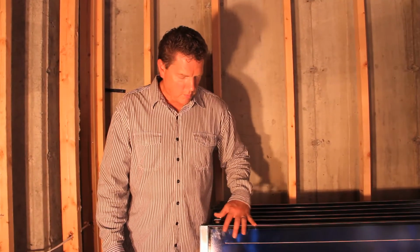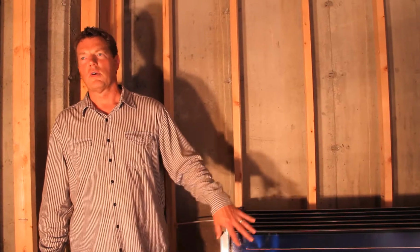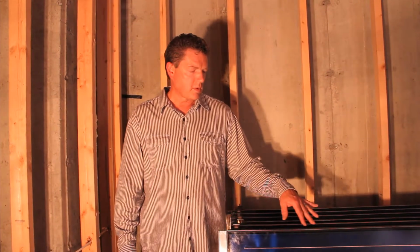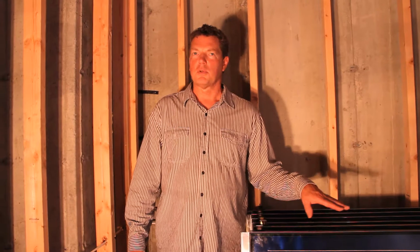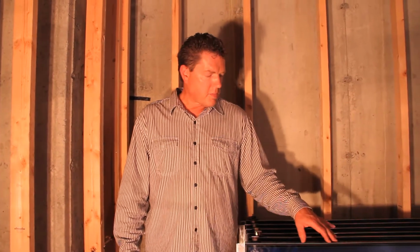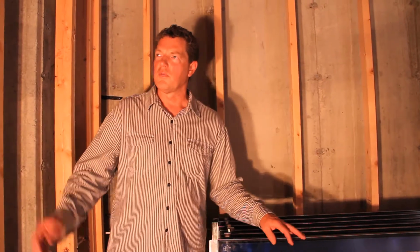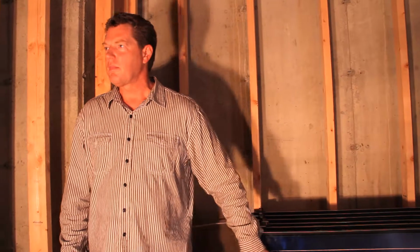Each individual panel will make approximately 22,000 BTU per day. And that's over a 5.5 hour period, because SRCC 100 rating states that we're only allowed to call it 5.5 hours. Because in the winter we have, what, 3 hours of sunlight? And in the summer we have 8 hours. So somewhere they came up with a formula that says we have 5.5 hours to put the rating on the panel, all right? So this panel makes 22,000 BTU, so times 6, and you're way up there in the, what, 150 range.